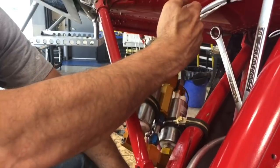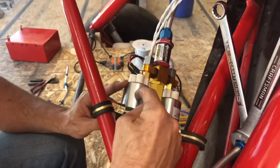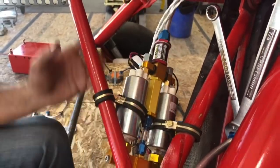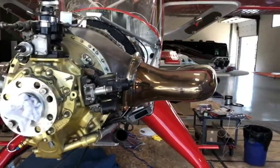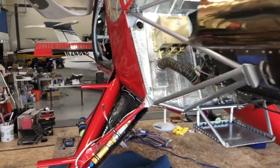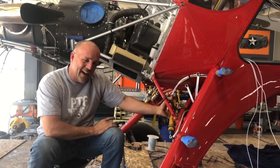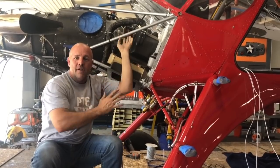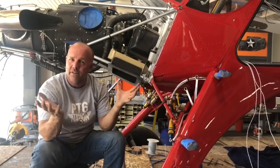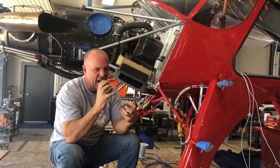Normally you could just go into one of these pumps to run the engine. I've got two pumps. I've got a pull-through line in case both pumps fail. I have check valves built into the head of each pump, so if one pump fails the other would run deadhead through that check valve and still operate. This engine has its own engine-driven gear pump, and then you have an electric pump that puts fuel to it. The engine can draw through these pumps so the electric pump isn't even required.